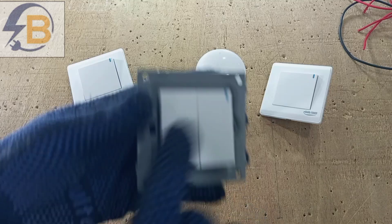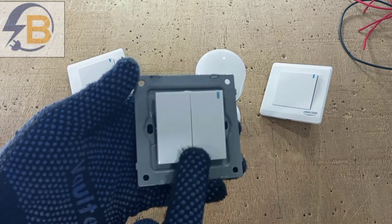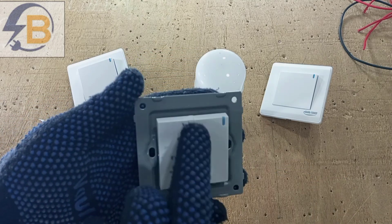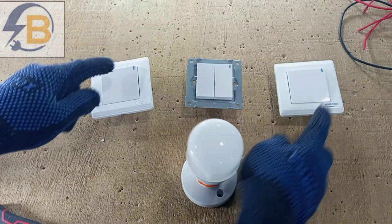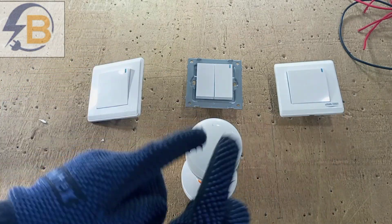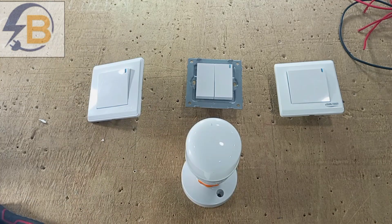We leave it for a little while to dry. Now that we are able to attach these two gangs together, it means they move together on each operation — they all go up and they all come down. Now we can wire this together with the two switches to control this one line.